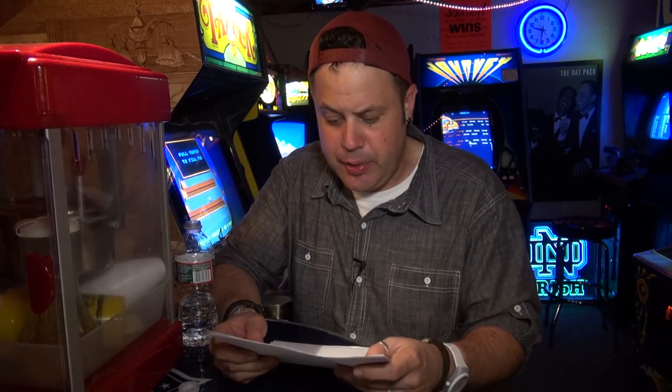Hey, John, Charlie Brown again. Glad the Jump Bug is finally done. Well, except for the monitor issue, which we fixed in this video. Anyways, my collection is slowly but surely growing, and I recently picked up a Hydro Thunder pretty cheap. The game worked, but that K7500 monitor was really dark. I pulled it out and saw a crack on the flyback. I ordered a new one along with a cap kit.